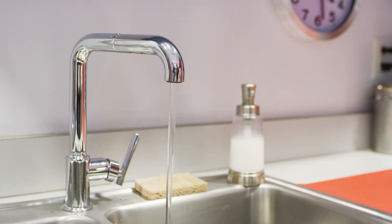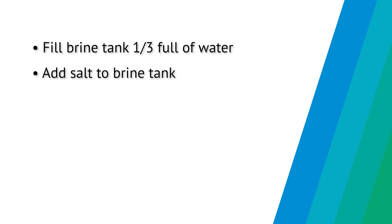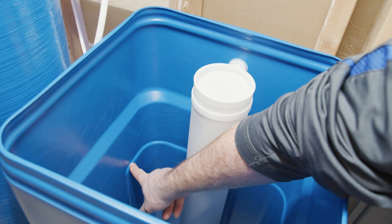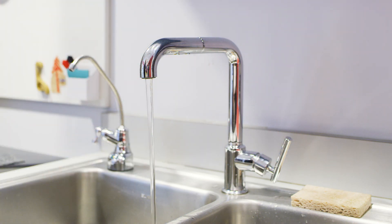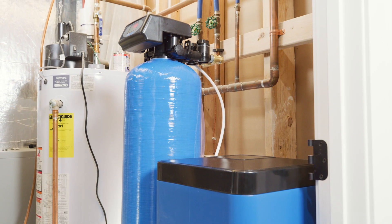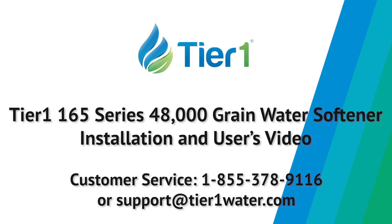Once the system flushing has been completed, you are ready to start your softener. Go to the faucet furthest from the unit, turn it on, and let the water flow until it runs clear. Now fill the brine tank about one-third full with water, then add salt to the brine tank. At a minimum, add 40 pounds, or any amount up to the 120 pound maximum — the tank should be close to two-thirds full of salt. Replace the brine tank cover. Go to the faucet in your home furthest from the unit, turn it on, and let the water flow until the plumbing lines have been purged of air or any debris. Sputtering from the faucet is normal when flushing water lines after a new installation. Your water softener should now be fully operational. If you have any further questions about the installation of your water softener system, please reference the instructions included with your unit, visit our website, or contact our customer service department. We're here to help.